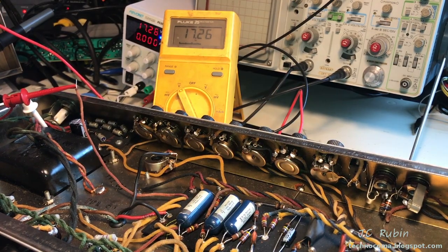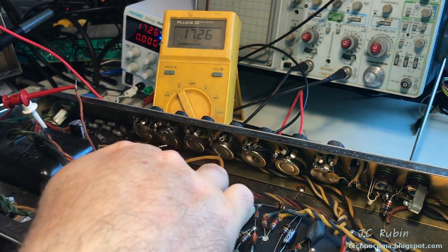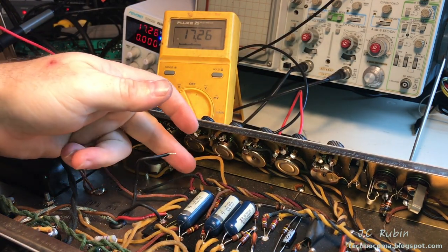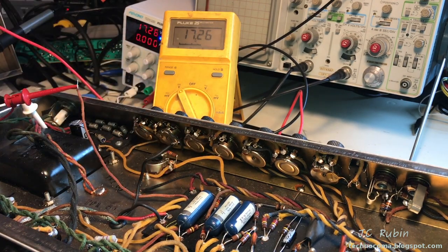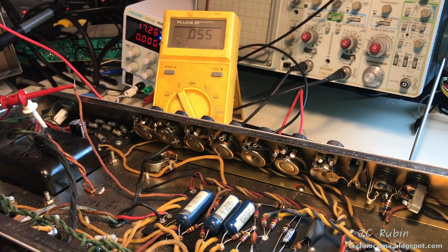I have lifted the return of the TR2, right? Comes in after the circuit is completed, goes through TR2, comes out, and it goes back to the capacitors on the top side, right? I've lifted that. And we're looking at the test voltage. I got the standby switch. Now watch. And it is off. And it is back on. We're slowly finding our smoking gun.